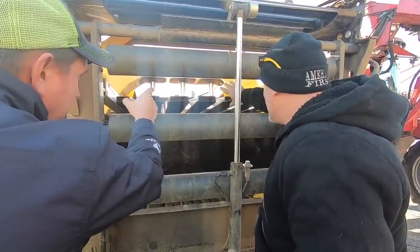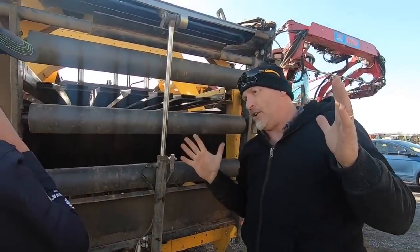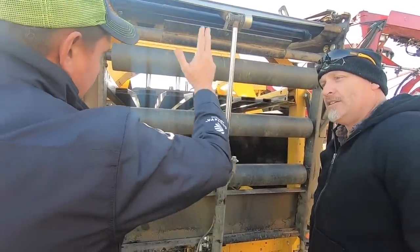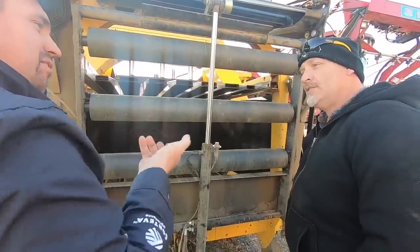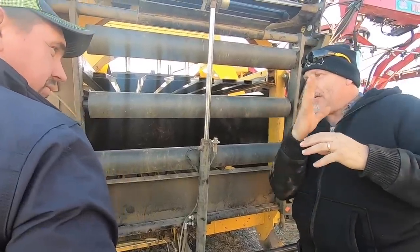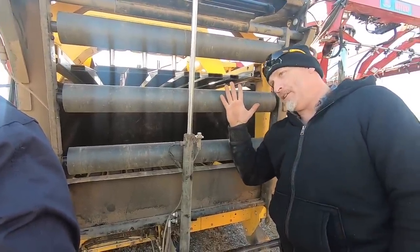It's too big. Well, not the cylinders themselves, but when you go to eject your John Deere, if you release the pressure off of yours, will that bale go back and forth? Yes. It lifts the top sides there and it goes out. Yeah. But then when you go to lift, these will lift the bale up, and then it'll dig the bottom of the bale out, and you can't get it out. Well, the chrome will dig in, and then when you go to reset it, it'll actually pull the bale back up into the damn chamber.